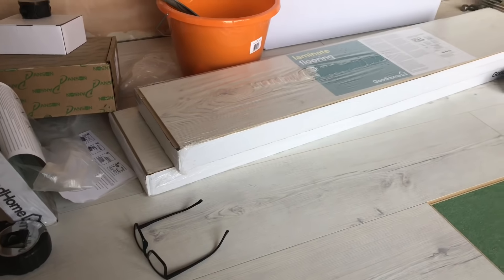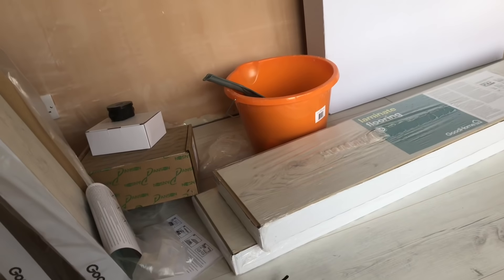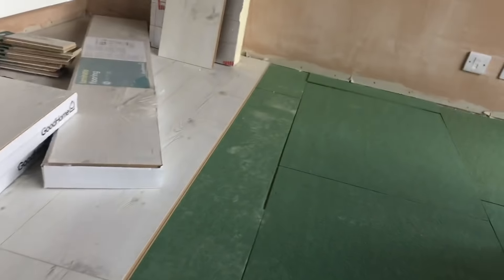What I said about it being good quality floors just came back to bite me — never had this problem with this flooring before, but maybe it's just been machined wrong. You can see this part here: that joint's nice, that joint's nice, but that board there is actually narrower than that board — not by a lot, but by enough. That joint is complete and that joint isn't, so I'm going to take that piece out, bin it, and lose the other bit too. That's one of the problems you can face — see the definite size difference in those boards.